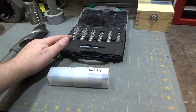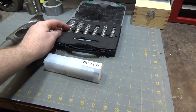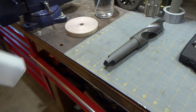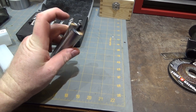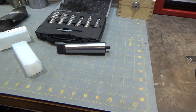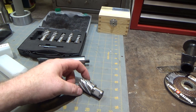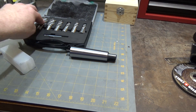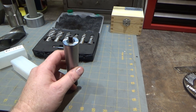What I want to do is make an adapter to fit in the tail stock of the lathe. I could try to find a chuck that'll hold a three-quarter inch shank, but instead it's going to be pretty easy to make an adapter, because I can start with this MT4 to 3/8-24 threaded part. It's ground flat, and all I need to do is make a holder with a threaded back. With the lathe in the normal direction, the annular cutter is going to want to cut and this is going to want to tighten the thread — so everything works in your favor with traditional lathe rotation, which probably isn't an accident.